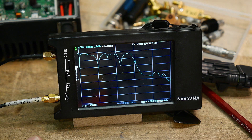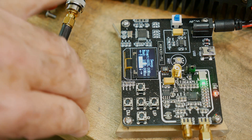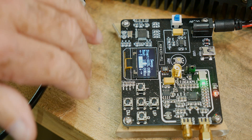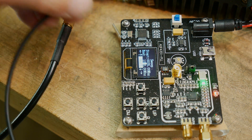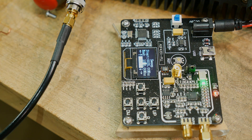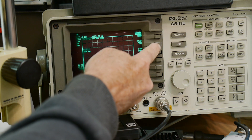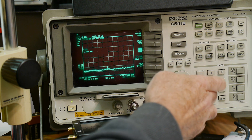Since I've got the equipment I'll use it. I'm going to use this little sweep generator — sorry, the dryer is on in the background making some noise. So I'm going to use the sweep generator and inject the signal. I have it sweeping between 35 megahertz and 1,000 megahertz. I'll go up here to the spectrum analyzer, set the start frequency to 35 megahertz, stop frequency 1 gigahertz.